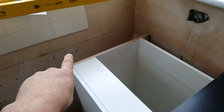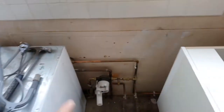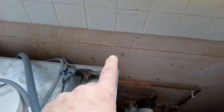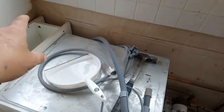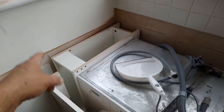That little track came in useful again in this tight little space. I'll put a two-by-one against the wall there to take the end of the worktop. I'll put this unit back in and fix it — I'm going to have to pack it off the wall because it's a bit like that one. Another two-by-one at the back of the washing machine area. The drainers go in here so that definitely needs a piece.